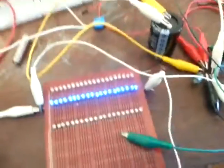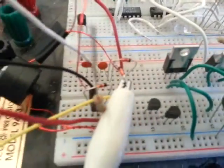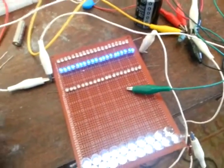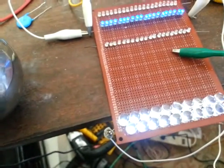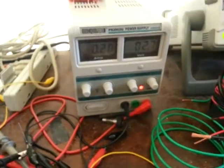There, finally, got the lights on. 40 millivolts. Scope's not connected to anything. There. And here. This is that green starter wire I've been touching in between those two caps. I don't know. Last night it was up to 70 millivolts, and touching the probe was making it better. There. So that went up to 200 millivolts.